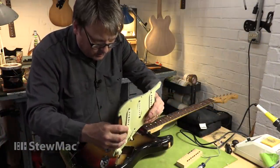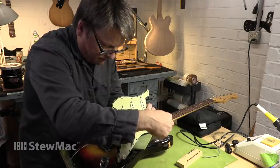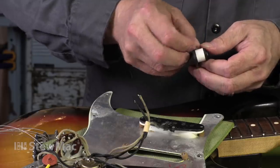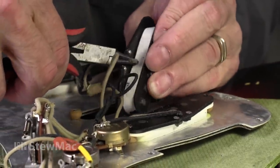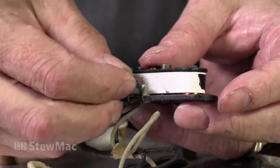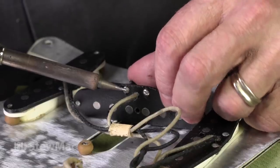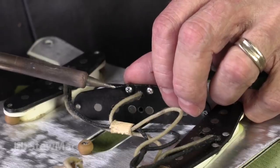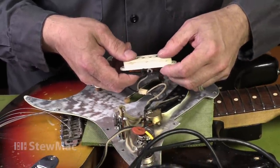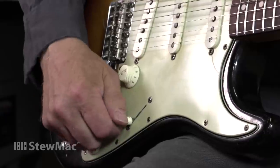I'm going to undo the pickguard and drop this pickup back in. I'm going to prepare these wires for re-soldering, got the little safety belt back on, and I'm working these wires up through the bottom. Those guys are ready to solder. I'm going to put my thumb on that because when I heat up this joint it's going to soften the solder and I'm going to push that right on in. I'm going to remove the little safety belt, put the cover back on, and drop this pickup back in. The pickguard's back on, the screws are in the same holes they came out of. Let's turn this pickup on and see what we got.